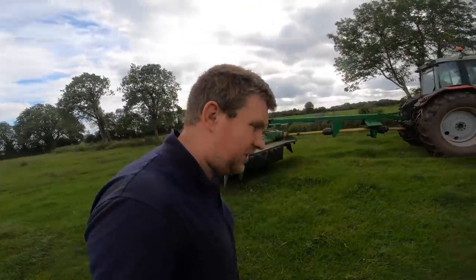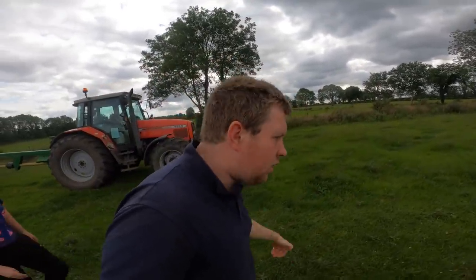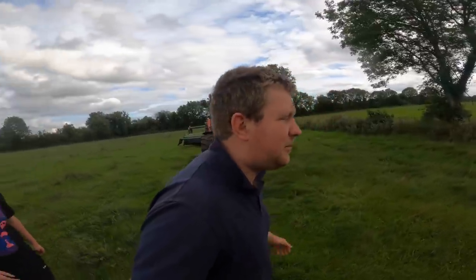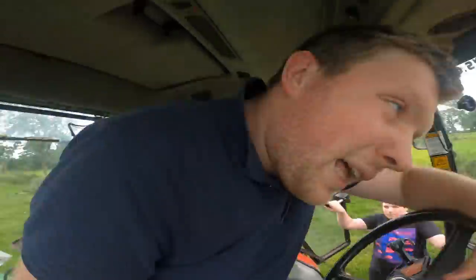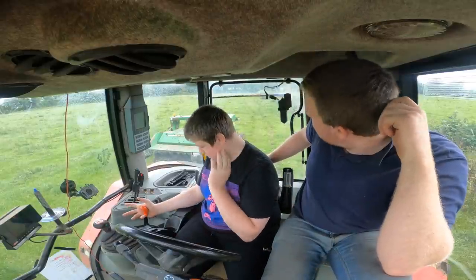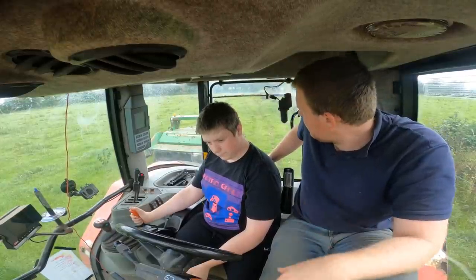As you've seen in the drone footage, the bulls are quite bad for digging holes, pawing up the face, and pulling stuff out the backs of hedges and around the trees — it's actually the worst year we've seen for pawing. Anyways, I'll do the first round of the field to mark it out for Bro and then we'll let him at it. So Bro, the PTO's been engaged — rev it up to about 1,700 to 1,800 revs, nice and smoothly, no jerking it because of the overrun on the PTO.